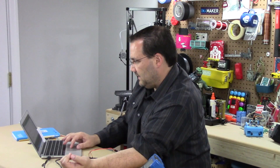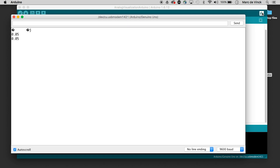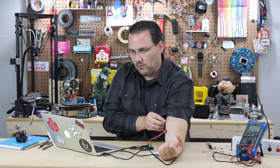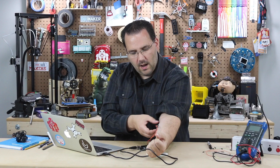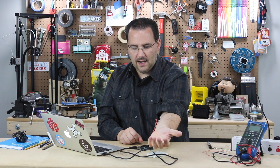Laptop's not plugged in. I'll plug the Arduino in, make sure my board and port are set, and upload the code. Done uploading — I'm going to open up the serial monitor. You can see I'm reading basically zero volts. As I flex, I can increase that voltage quite a bit, getting up to about one. I'd probably tweak the placement to get a better voltage out of it. After moving it a little bit, we're starting to see more voltage as I flex my arm — and there we go, we're getting a good three to four volts out of that sensor.